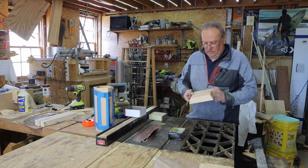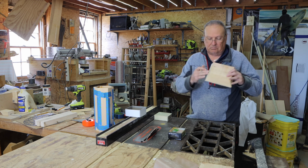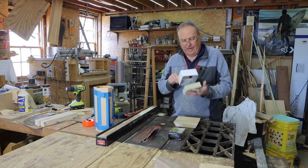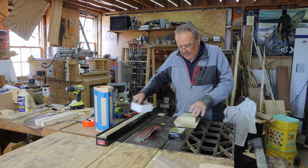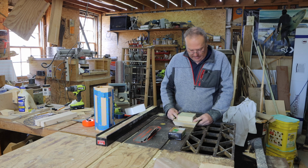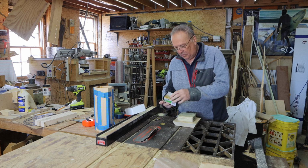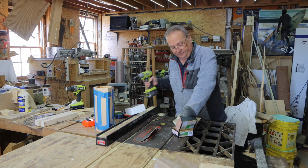All right, so I beveled the side so that it's all nice and kind of coast-type. I also made a block that is going to fit inside my post. I drew diagonals on the big board on the base so that I can line this up. And then I'm just going to take a couple of exterior-grade screws and secure it there.